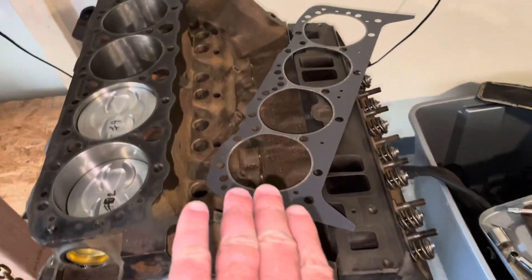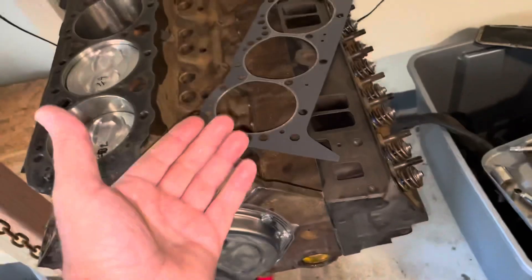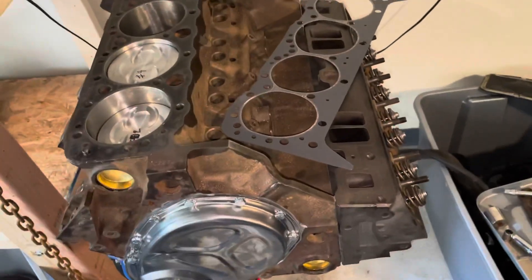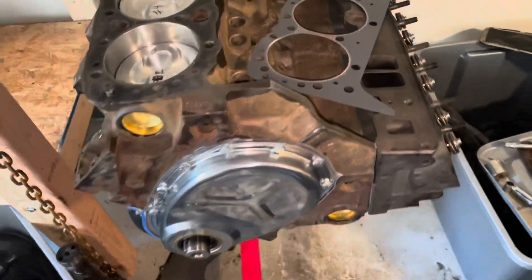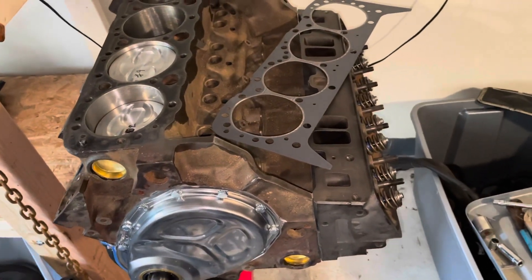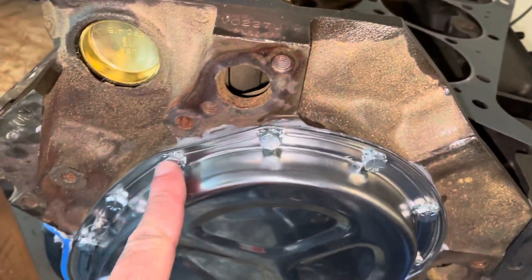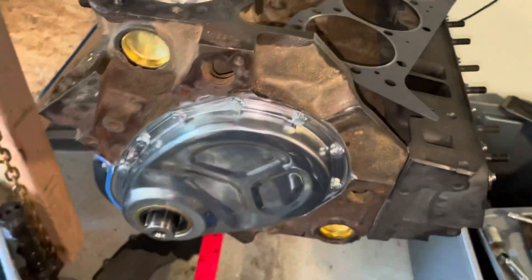That's how it works on a car or truck. Marine engines are a little bit different — the thermostat doesn't block water going out to the water source. The water continuously circulates through the water pump, through the heads, back up into the intake, and back into the water pump. There's full-time circulation in a marine engine, so you don't really need to bypass.